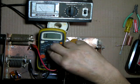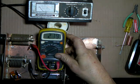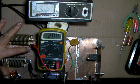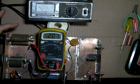Okay, it's more than 200 pF. It comes out that when this one's in resonance, we're at basically 208, we could call it 210. There it rested at 2.7. So that's 207 picofarad for the output cap. So you can see with this 110 pad cap, this capacitor wouldn't be enough right at that point. It would be almost closed at that.